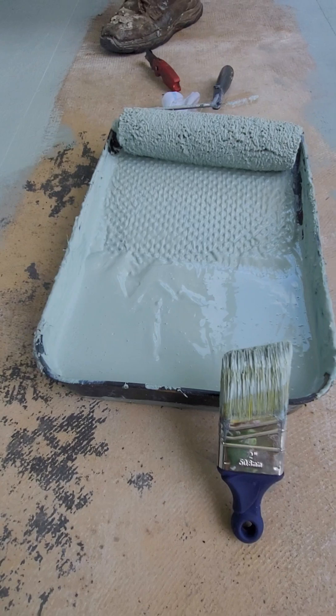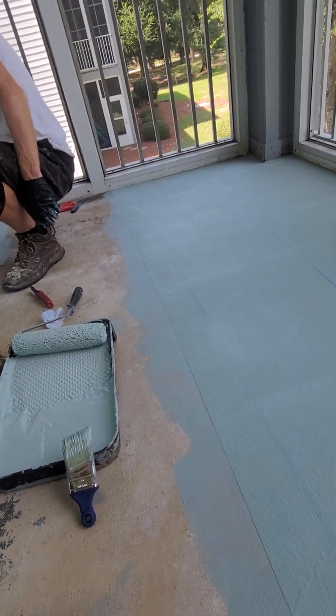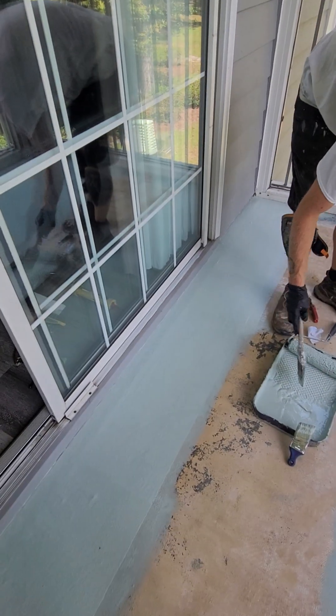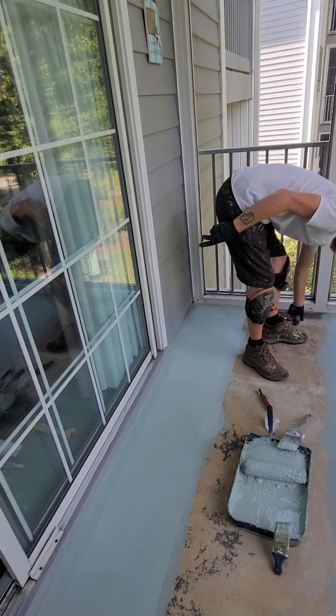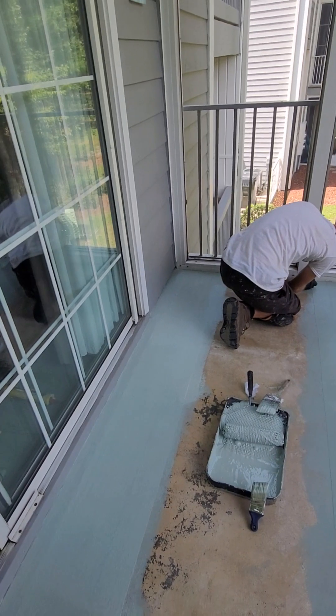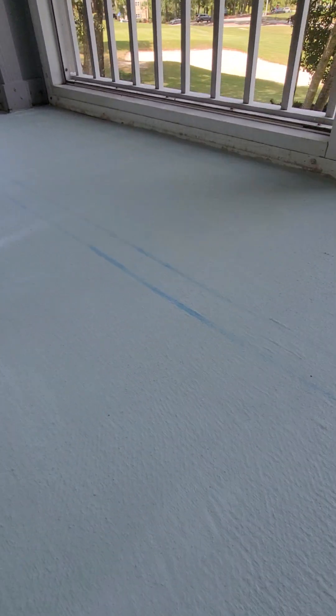You have that strong top layer, and you're using that strong top layer as a foundation to put another coat. Then you have a true two layers even though it doesn't look like it. If you cut it and looked at it with a microscope, you would see two distinct layers. If you do one thick coat, you don't have strength that way. It looks good but it's not nearly as durable as two thin coats. Two thin coats will always outperform a thick coat — you're better off with two thin, very well applied with a slight pressure on the roller. Wait for the oxidized layer between coats — at least surface dry. See how that's shiny right there? See that? That's not dry. It's not time to recoat that. But put that down there — we can recoat because it's oxidized. See, it doesn't stick now.